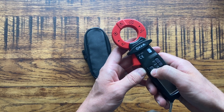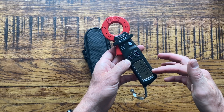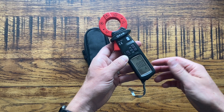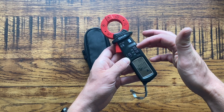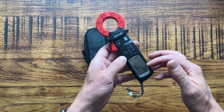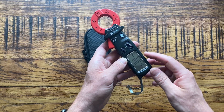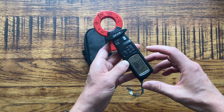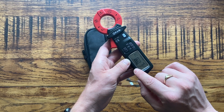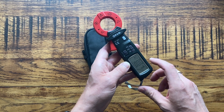It's very simple — you turn it on using this on/off switch and you've got a milliamp reading or an amp reading depending on the setting. The 60-amp setting reads up to 60 amps. The 20-milliamp setting measures in milliamps to two decimal points. Then you've got the 2-milliamp setting, which gives you a reading to three decimal places — that's the really handy one for earth leakage work.